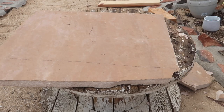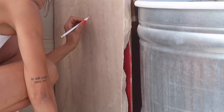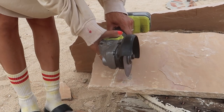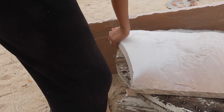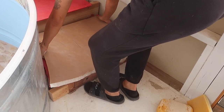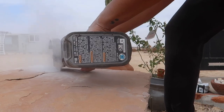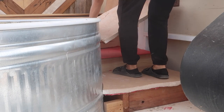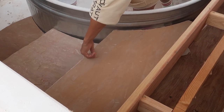I tested hand-chiseling the flagstone pieces like I did previously for the flat part of the pool, and I kind of want to carve in 'wild.' I tested the first big cut before feeling comfortable doing the stairs. We also needed to cut curves to go around the pool, which was a little intimidating, but getting a masonry bit on my angle grinder and going little by little felt like cutting through butter — I could cut a perfect curve, which was really empowering. Once Allie and I got in the groove we busted through it, labeling the steps so we knew which one went where, and once they were all solid we added thinset and really secured them onto the hardy backer board.